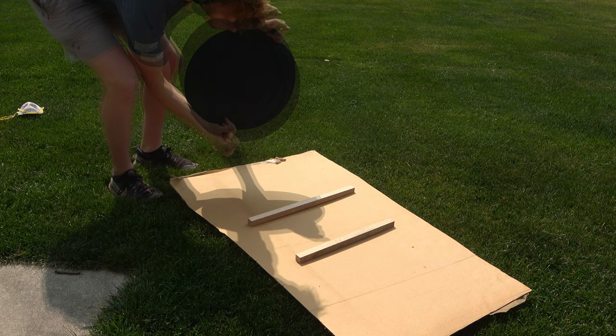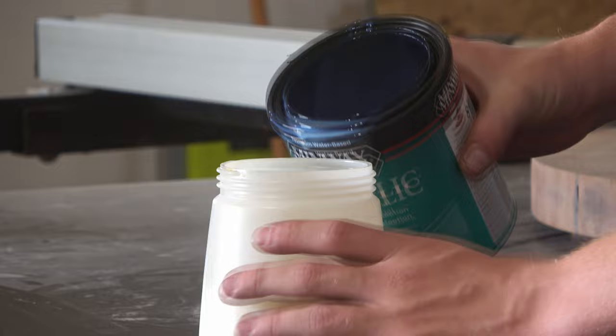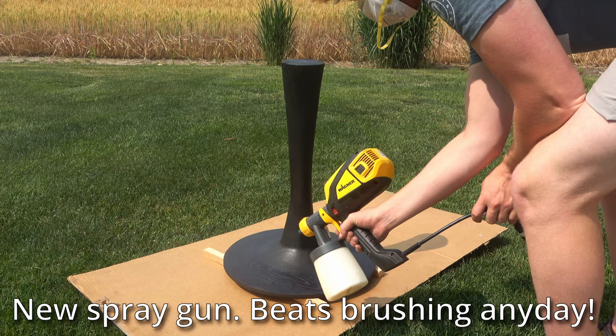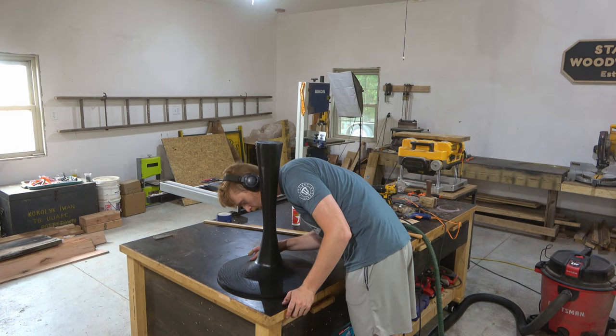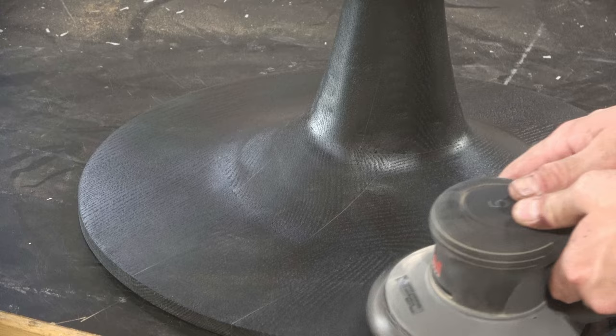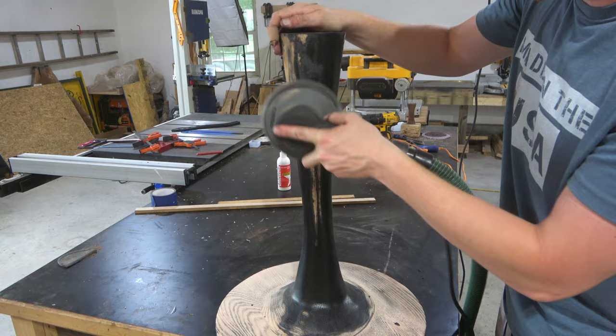By the way, there was a video of that gap mistake I made earlier — I bet you didn't even notice it. Now you're going back to see if you can pick it out. Well, there's some instant karma here because I did something pretty stupid: after I sprayed on the finish, I let it sit out in the sun a little too long. Black attracts a lot of heat and it caused the wood to expand, which made tiny noticeable gaps in the glue line. I had to sand off all the dye and refinish it, but once I did that you'd never notice — so it was a pretty easy fix.